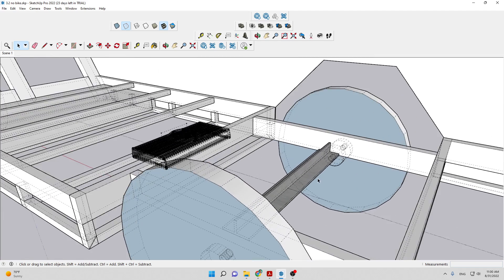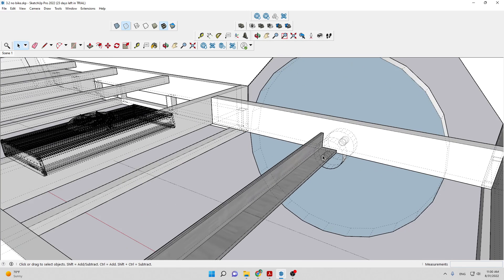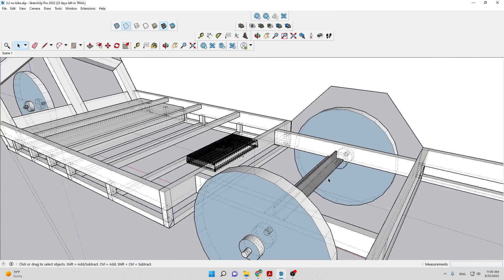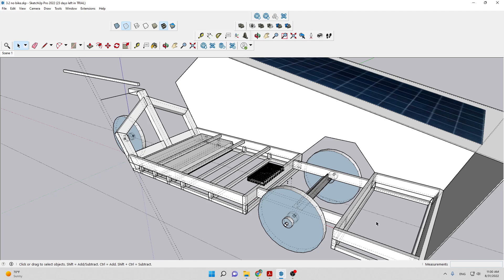The axle will be Flexi Ride four and twenty-five pound half axles, and I'm planning on using back-to-back angle with another plate of aluminum underneath to make that thickness one quarter of an inch. Then I'm going to mount the half axles and bolt them into this mounting plate slash support beam. The wheels are offset because the axles are like trailing arms — the Flexi Ride spindles come out this way and then out that way.